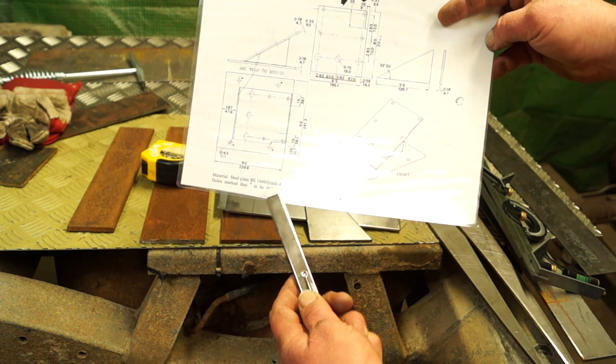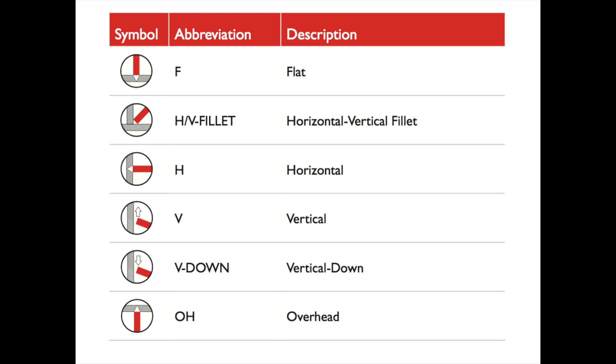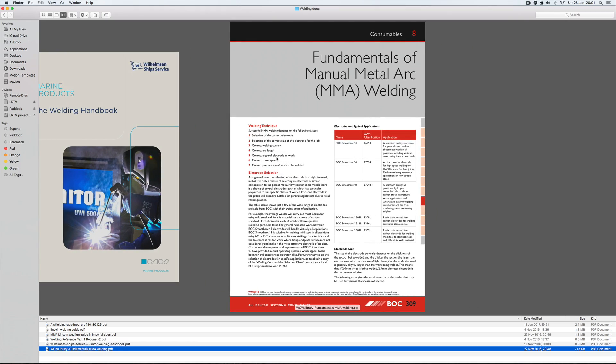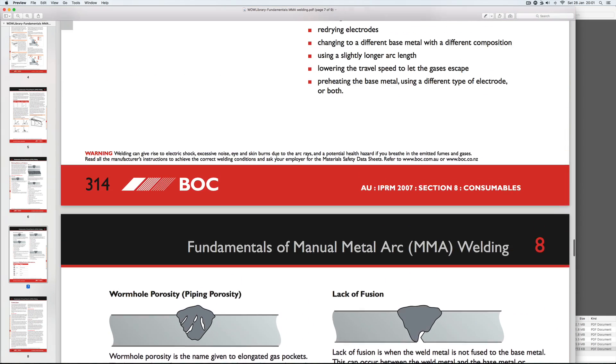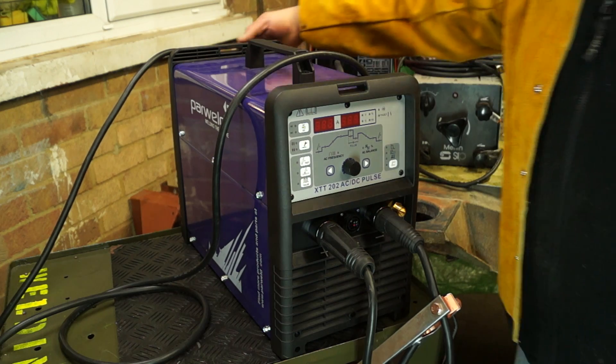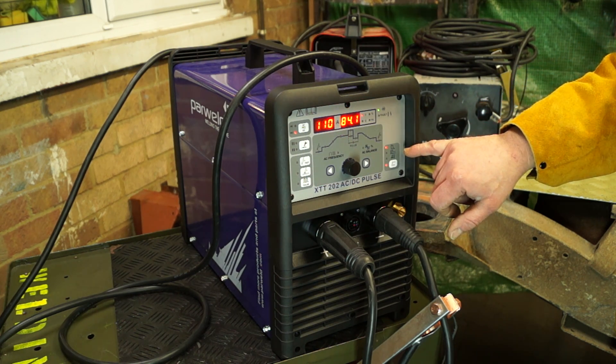I've just got to go through a few more things with stick welding because the details are really important. In the next video I'll talk about the amperage to the size of rods — you have a current range; for instance, 3.2 will be a current range between 110 and 130, and it does vary depending on how you're actually welding. The welding positions — flat, fillet, horizontal, vertical, vertical down, and overhead — we will have to cover these because it's important. The position of your welding will determine your voltage and how you're going to weld. So bear with me — I know it's a bit tedious, this theory work, but for electrode manual metal arc welding, it's important you get the theory well nailed.